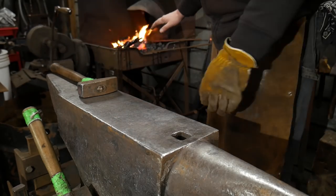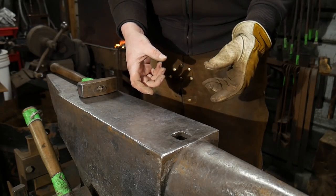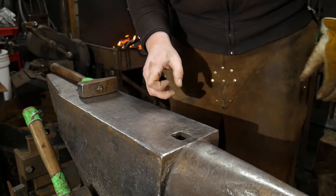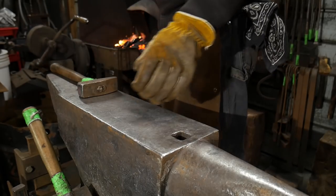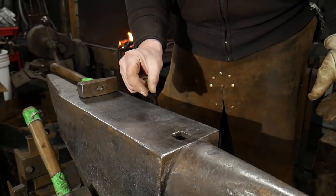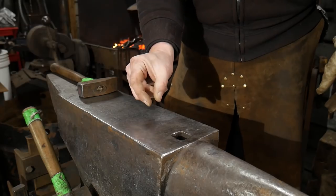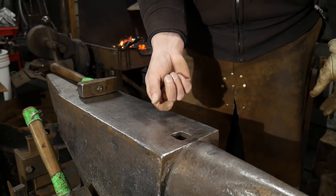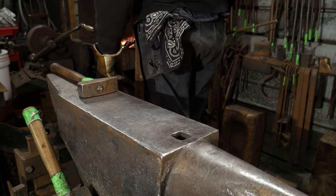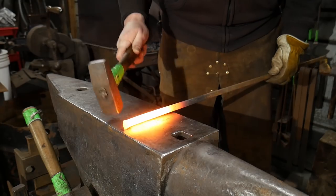The first thing — I've got my two pieces of material in the fire. I've got my collaring material that I'm going to make the collar out of, and then I've got the main bar that I'm going to collar to. The main bar is a piece of half inch round stock, or 12.5 millimeters. The collar material is quarter inch or three sixteenths, about 4.5 millimeters, by roughly half inch or 12.5 millimeters. The first step is to draw down a taper — just a short little taper on the end — to create a scarf.